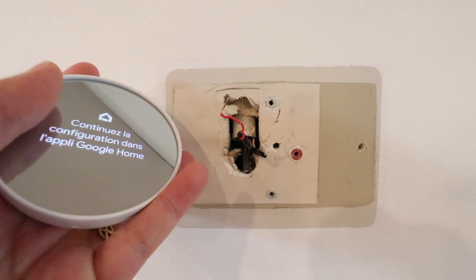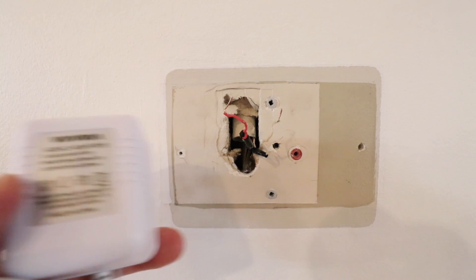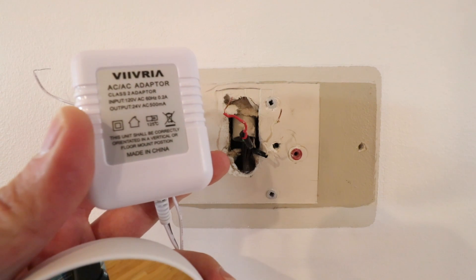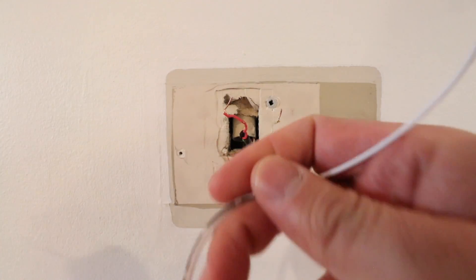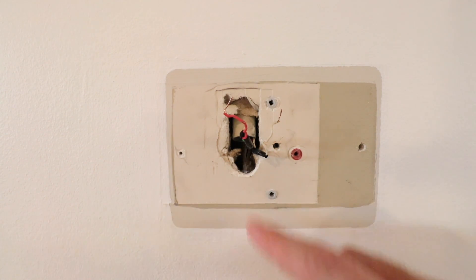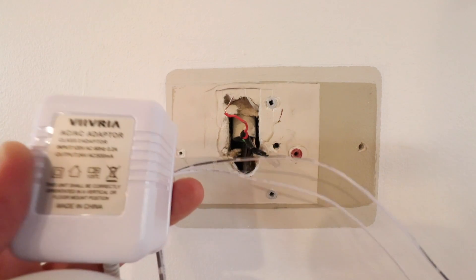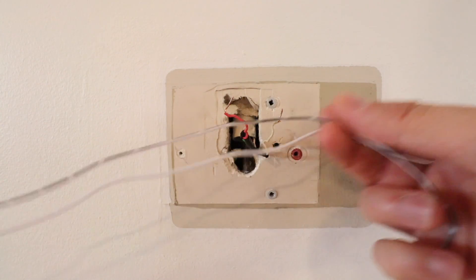It's important to note that the new Nest thermostat will not work with a two-wire system without a common wire or common wire adapter. What we've got is a common wire adapter, and we're going to need this for the next step — wiring up the base plate. This common wire adapter plugs into a standard wall outlet, and you run the two wires that come with the adapter up to the thermostat. You can do that surface mounted, or depending on your local code and regulations, you could fish this through the wall, connect it to thermostat wire, and conceal it with a power outlet cover or put it in a closet.